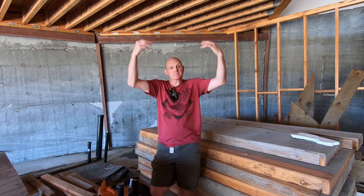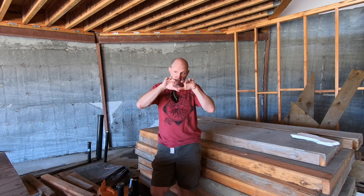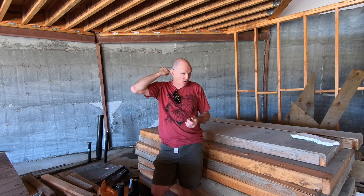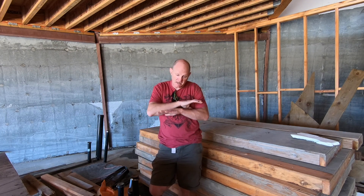So you're going to do this for the top — they pulled the boards down. These guys shot the first floor, shot the first layer, shot the second layer, then pulled all the scaffold and boards down, plugged all the holes, not realizing they needed that to work on the next layer. So when they got up near the top, it was very difficult. They made a lot more work for themselves. The way you want to do this is set everything up beforehand — all the scaffolding, all the jacks, anything you're going to work off of.